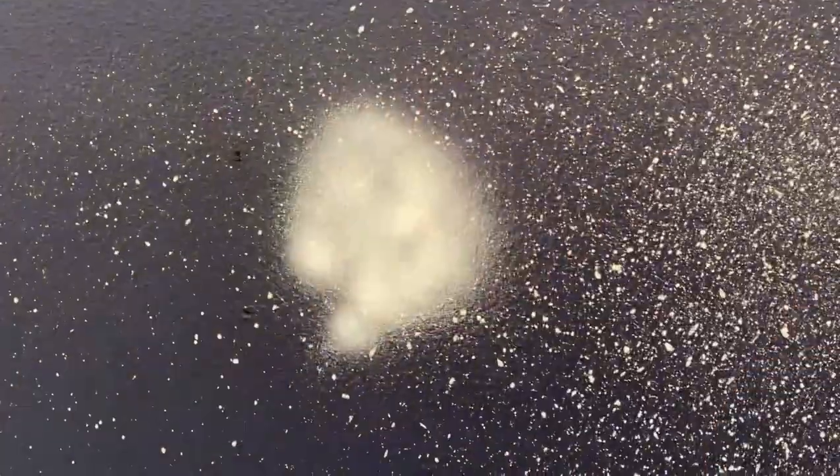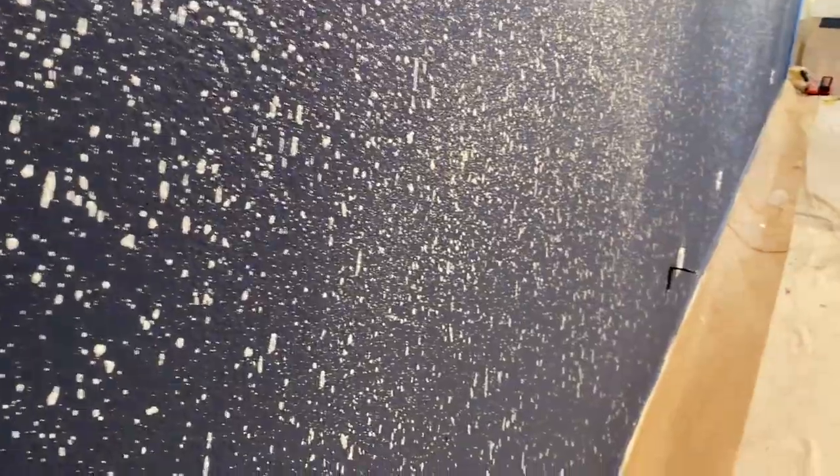I'm feathering it out. We feather paint, we feather compound when we skim coat. I'm feathering the texture because this is, I call it dangerous. It's dangerous. You could risk making the wall look worse. But guess what? It worked perfectly. If you want to feather it in, stay back. The rule of thumb for adding texture from a can is 12 inches, but not when you're feathering it in. I'm 24 to 30 inches away. I just want to put a little texture on the surface just to take attention away from the flashing she made in that concentrated area. You see that? I feathered it out several feet away.